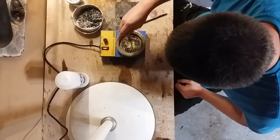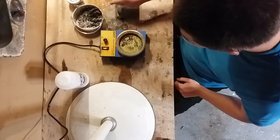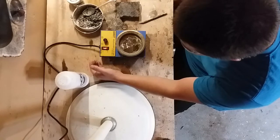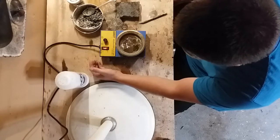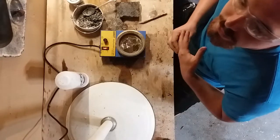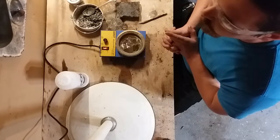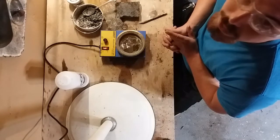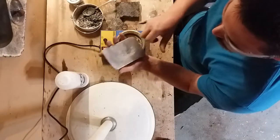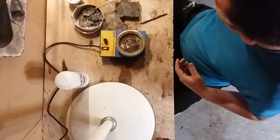So we can see here now we've got a fairly clean product — a lot less oxide, a lot less waste. That's the first batch of purifying. I'll show a video where I'll do it in a bigger batch where I'll superheat lead to get it all to come down in my furnace, which also melts all the other stuff with it, so it's not the best way to do it but it's the fastest. Eventually we'll get to this brick, or whatever you want to call it. It's heavy.